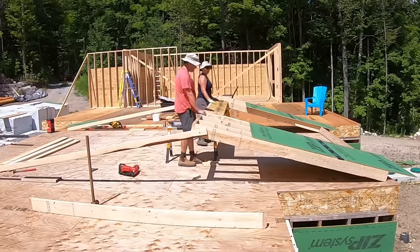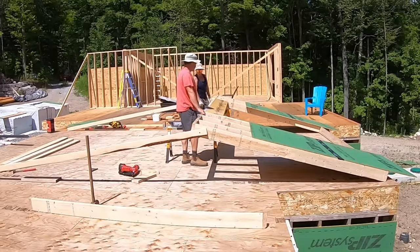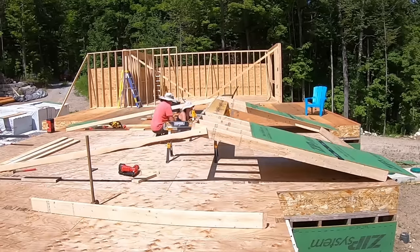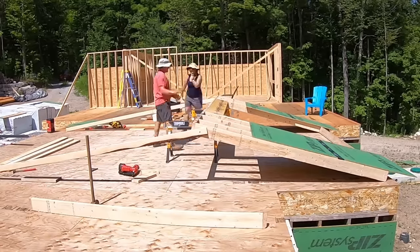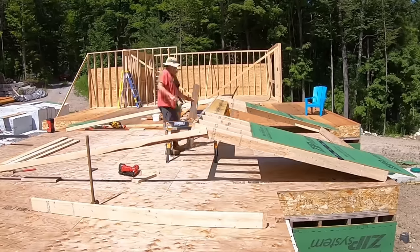With the triple LVL header and the zip sheathing, the wall was just too heavy to make that transition from having it underhanded at your hips to get under and lift it up past our shoulders. Luckily, we had the sawhorses there, so nobody was hurt.